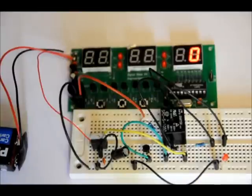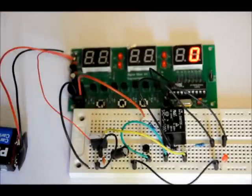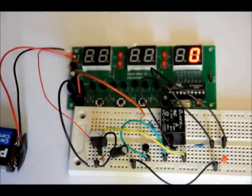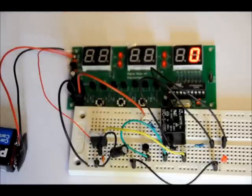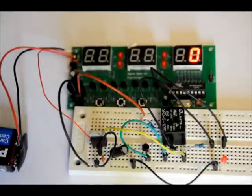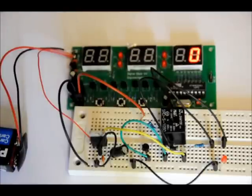One of our relay kits would be very well interfaced with this. However, the 7805 is required because we're using the battery to power the board and the relay circuit separately, because the 7805 on the board here can't power both this device and the relay — the relay demands a bit more power. And it would get really hot and you might damage it or certainly screw up the operation of your clock temporarily.